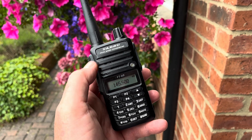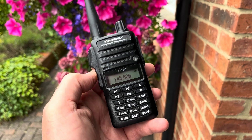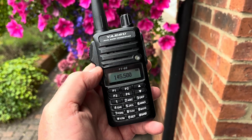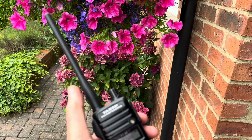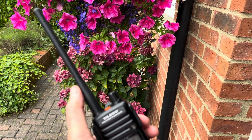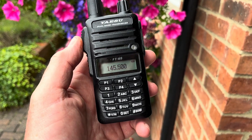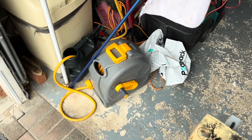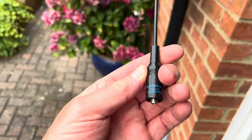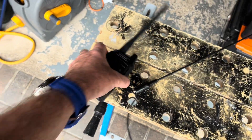Hi and welcome to the channel. Like many of you, I've got a handheld walkie-talkie — this is a Yaesu FT65 dual band radio, 2m and 70cm FM. Nice build, nice quality. The stock antenna, which is a dual band antenna, maybe doesn't perform as well as it might. I've also got the quarter wave whip Nagoya, also dual band, but I'm sure I can get better results if I make my own.